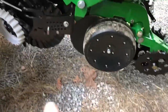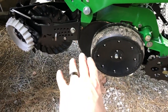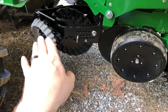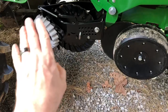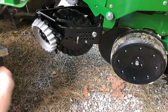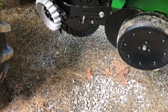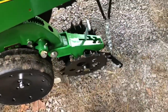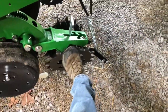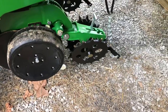I'm looking at where my no-till coulter is in relation to my opener and my row cleaners. I want the row cleaners just clearing the surface — not digging, just scratching away the material at the top of the ground. The field is dead but it had some fine grass in it, not overly thick, and I need that cleared out of the way. I'm hoping I don't run into an issue with the spike-tooth closers getting caught up in that stuff and wrapping around. I think it's not tall enough to wrap — it'll just get smashed flat.